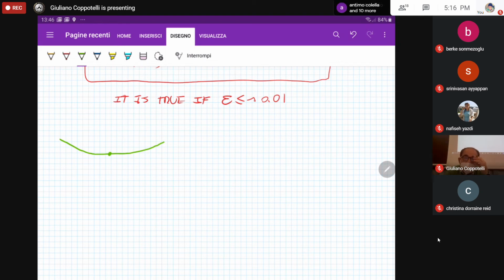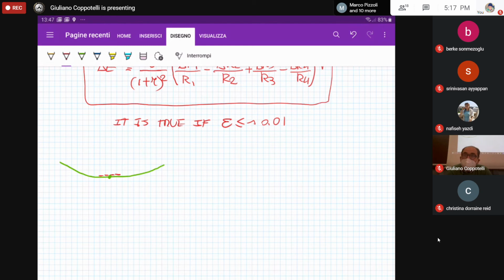If now I am using 4 strain gauges in the way that I just told you, let's assume to bond these strain gauges here, 1, 2, 3, and 4. These very tiny pieces of lines are representing your strain gauges. And assuming that these lines are so tiny that they are approximately sensing the same strain, which is not true from the physical point of view, but let's assume that they are measuring the same strain field.